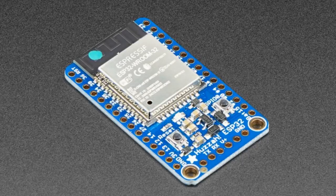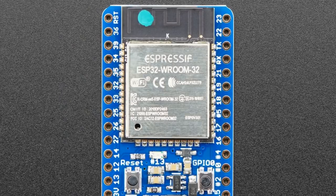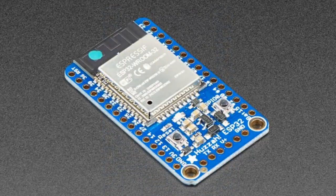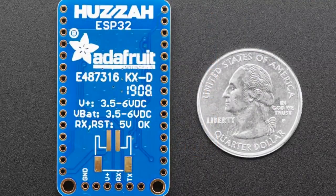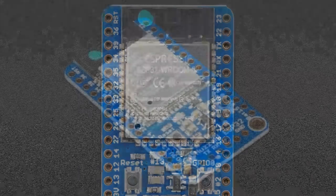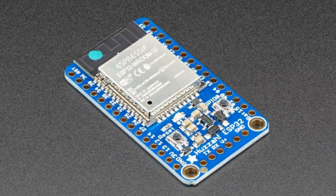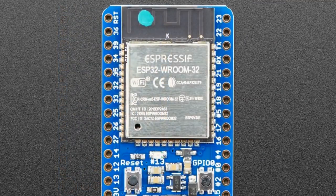The reason for the top hat is we have this ESP32. There's a basic breakout for the ESP32 — we have breakouts for the HUZZAH ESP32, and a Feather — but as I've been doing more ESP32 Wi-Fi coprocessor stuff, I thought it'd be great to have just the chip: no USB serial converter, no battery charger. This is a very small, minimal ESP32 breakout with all the pins broken out, a power regulator, two buttons for GPIO 0 and reset, and an LED. You program it with an FTDI cable. It comes pre-programmed with the ESP32 SPI coprocessor code, so if you want to use it with a CircuitPython board or Arduino code as a Wi-Fi coprocessor it works out of the box. You can also program it with the Espressif IDF or Arduino IDE. Because it's minimal, you can add your own USB serial converter and remove it to make it much smaller and lower power.